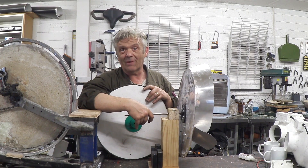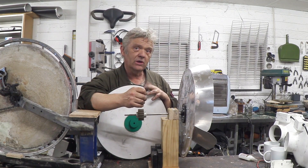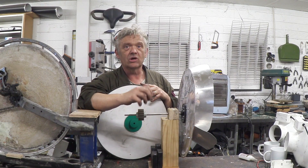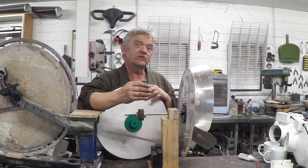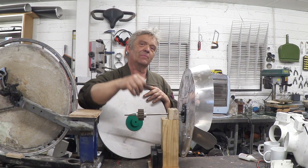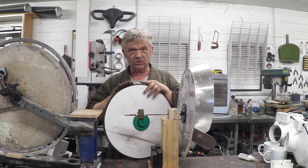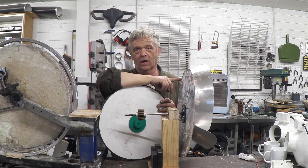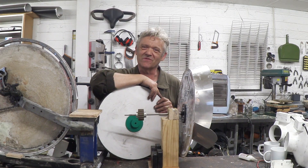You'll get pretty much the same power output either way. A high torque motor will turn slowly, giving you high amps and low volts. A low torque motor with a gear will turn quickly, giving you low amps and high volts. Power — watts — is volts times amps, so the power remains pretty much the same; it's just how it's fed out that differs. Anyway, we're actually going to start doing this now we've settled on this design. I'm a fan of rim drive design, and this cog is really just taking power off the rim — I'll probably do something along those lines on the large-scale Rows turbine. I hope you enjoyed the video and found it helpful. Thank you for watching and please remember to subscribe.